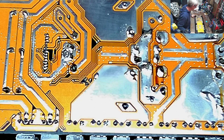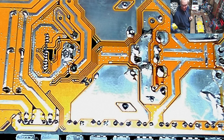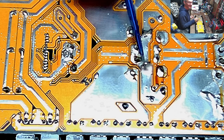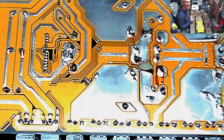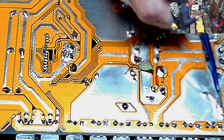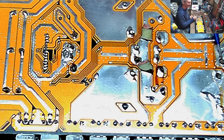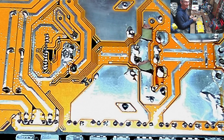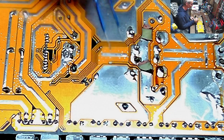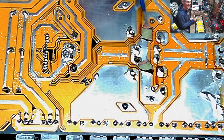It looks like what we have here is a failure to communicate. This amplifier got so hot that it melted all the solder. We blew the trace wide open, and the solder literally started to flow off the board. There's no solder left on the legs of this transformer — all the solder has pooled in one direction. This amplifier was actually mounted that way. That would probably be the reason why I don't have 12 volts on this transformer, because the 12 volts ends right here.